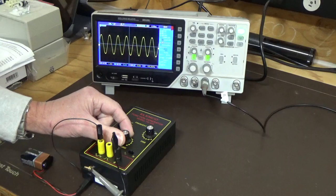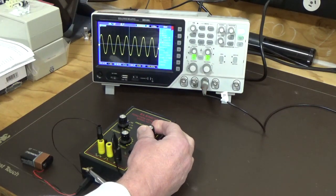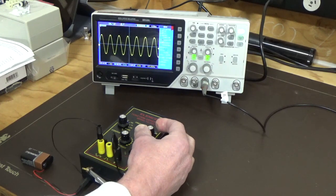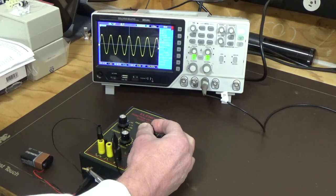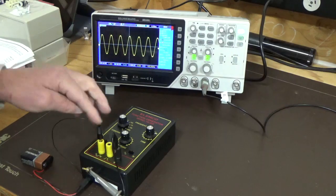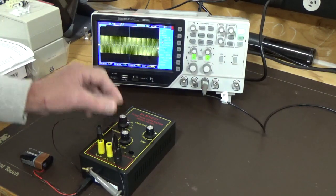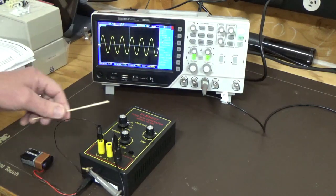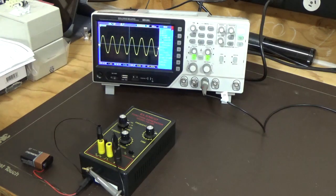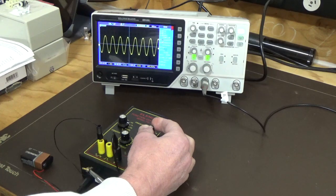I'll put it exactly on halfway, and the frequency is reading 109.10 at 100, so you just have to play around with that a little bit. You can see we're 105 now, 104. So you can get on frequency, but it is a little bit temperamental. We'll go up to 1K, and the signal's still looking pretty good. We're on about half amplitude there, and we're reading 951, so you just need to adjust up a bit.